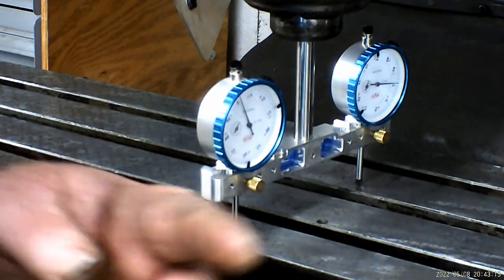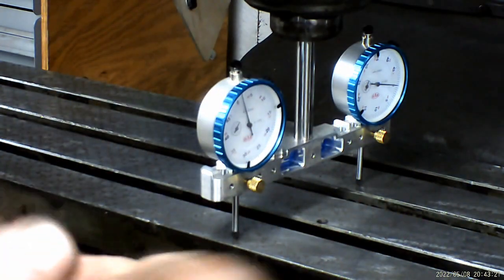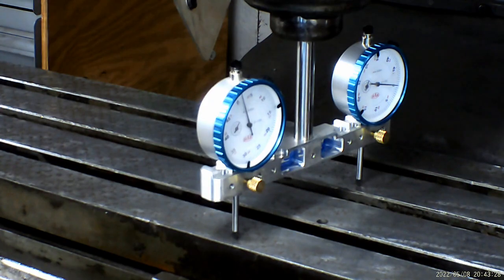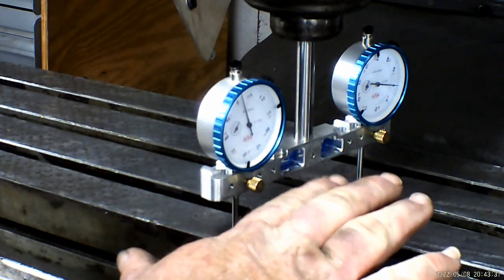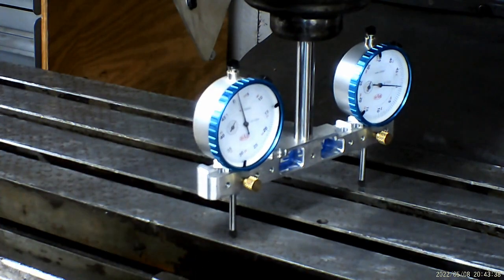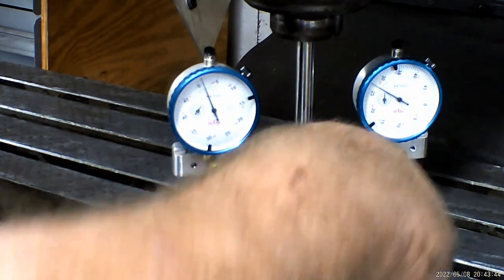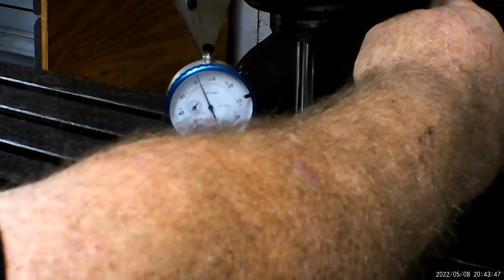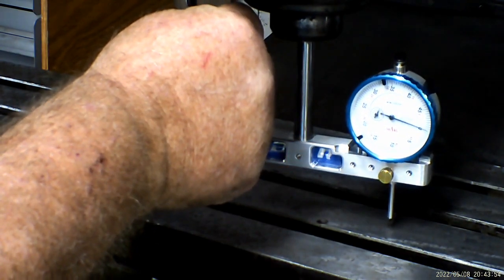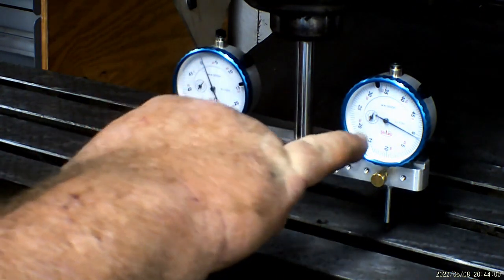I spent a little more time on it. What I was going to say is you'll watch the needles and they will start chasing each other — they'll catch up and pass each other, and you just have to find the sweet spot. I've gone back and re-zeroed the gauges to get everything at zero. You'll want to be careful to make sure your dial indicators don't get stuck in the slots as you come around. Both gauges are staying consistent; there are just a couple of divots right through here where they drop into a slot.